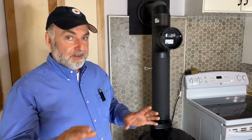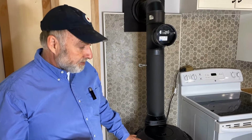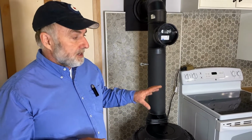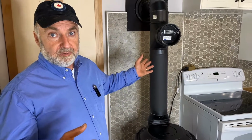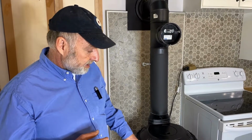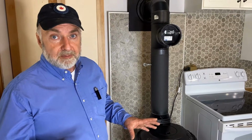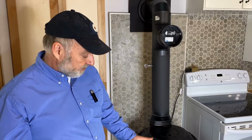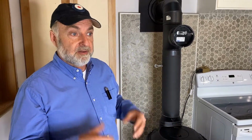It's kind of strange stuff. Lots of heat, tremendous run time on the burn, but then there's this tendency to go out, as I said. So that's a steady state adjustment, and we would only want to deviate from that in a big way if we were going to be servicing the stove. We can turn it down less than this, and we can get more heat out of it, but at no time during everyday use would you have that air vent open all the way. You don't want to give your anthracite fire that much air during a normal burning period.